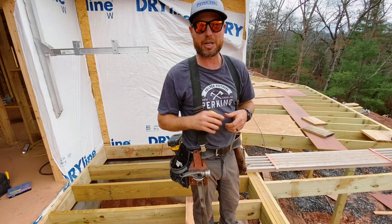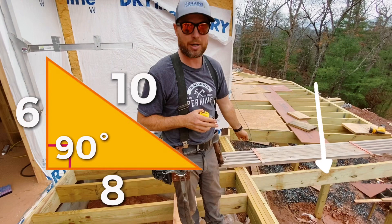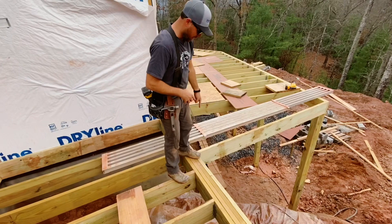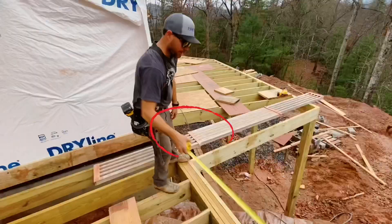We're going to figure out if this board right here is running off of our other board at 90 degrees, which is what we want. So I have a fixed point out here — I can't move this in, so I can only move this in. What I've done is measured 6 feet from this surface out to a mark right here. What I've also done is measured out 8 feet in this direction — you can see this screw way out here.